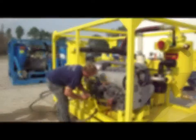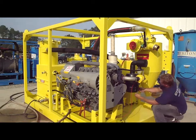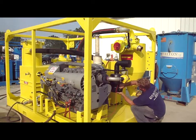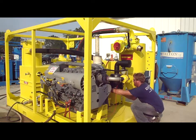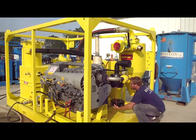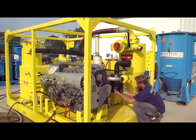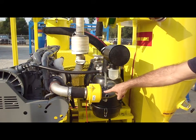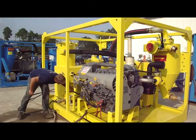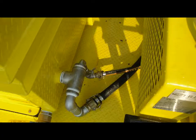Also, check the air filter. There is an oil level in the air filter and you can see the technician checking the sight glass for any level and dropping the pan here. Here is the side view of the air filter and the emergency shutdown device, or ESD, which should never be used for routine shutdowns. Next, open the primer valve between the water tank and the liquid ring pump. Here is the top view showing the location of that valve on the three-quarter inch line.